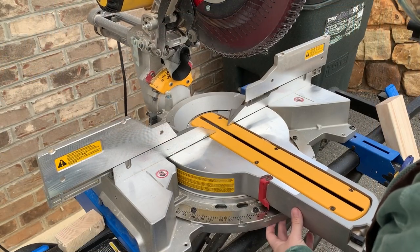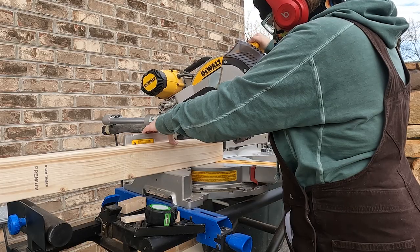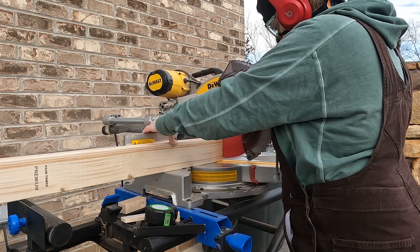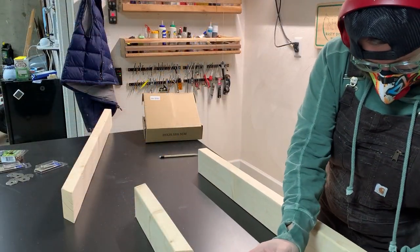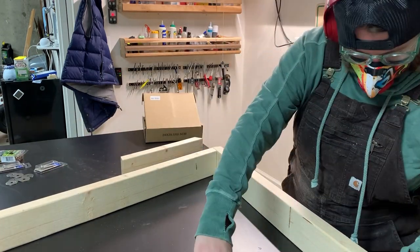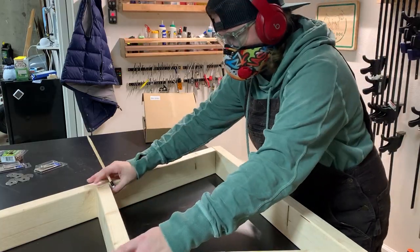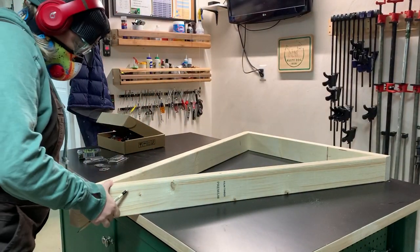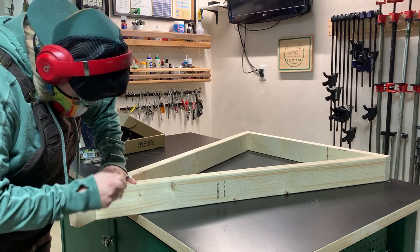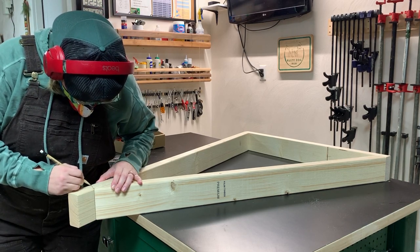With the base complete I moved on to creating the triangle-shaped part. I set my miter saw to 20 degrees and made a cut on one end of each of my two pieces — this end sits on the base. I cut one piece to about 41 and 1/2 inches long with one end at 20 degrees and one end at 50 degrees. For the other side piece I made it 43 and 7/8 inches, one end at 20 degrees, then marked where the pieces met and cut it on the miter saw. I also cut a middle shelf piece to about 14 and 5/8 inches with a 20-degree angle on each side.